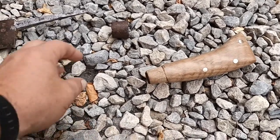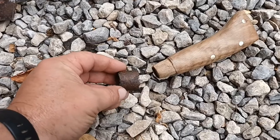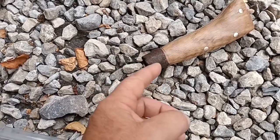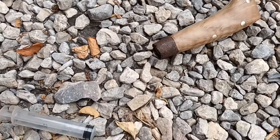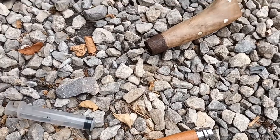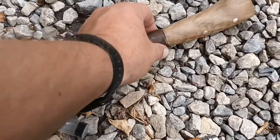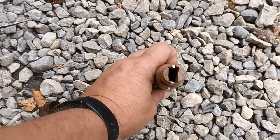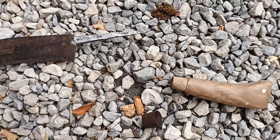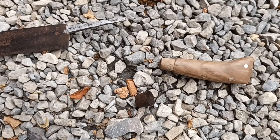What I'm going to do now, I've drawn a line on my handle, somewhere on this. There it is. Plop it in there. And to get it flat, draw a pencil line. And I'm just going to cut it with that, get a nice square, make sure it fits. And then with the epoxy resin, I'm going to fire it in there, cover that in there, squidge it in, wipe it off, leave it to set, and then it'll be boiled linseed and finish.